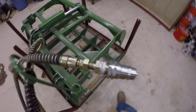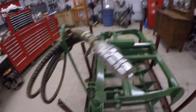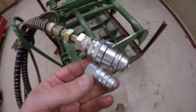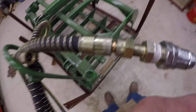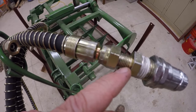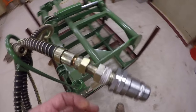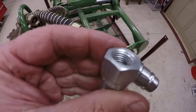Well, it wasn't as easy as I thought. This is how it came hooked together, and these fittings are too big to fit on the front of the tractor's loader hookups. What it needs is the next size smaller. I didn't realize until I unscrewed it — I was thinking the threaded part was part of the hose and I could just take that off and thread the fitting on. Unfortunately, the thread that came on this hose was metric, and this is a standard pipe thread fitting, so they won't thread on there. I thought I'd go to the hose guy that makes my hydraulic hoses and he would have a metric-to-standard thread fitting.